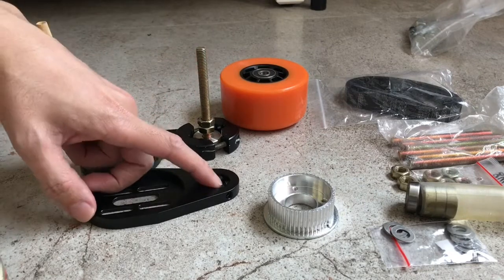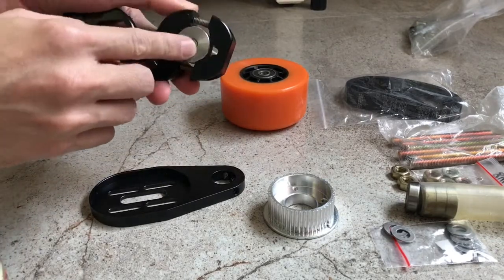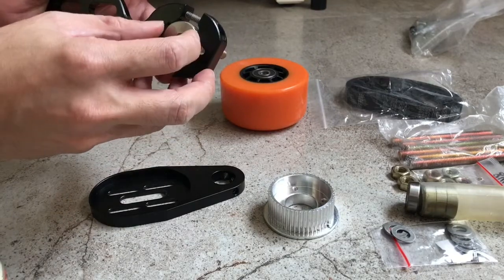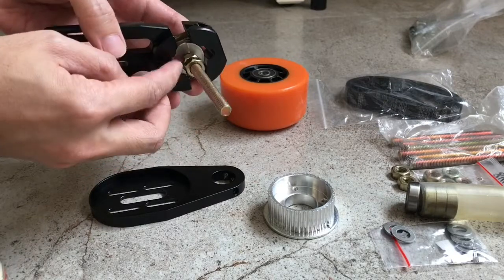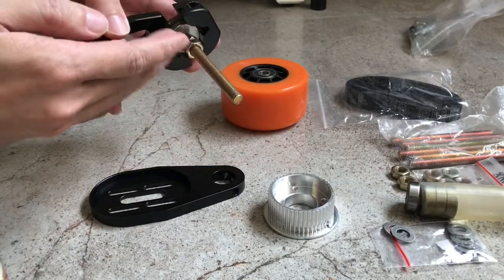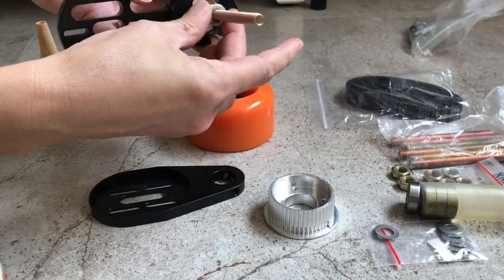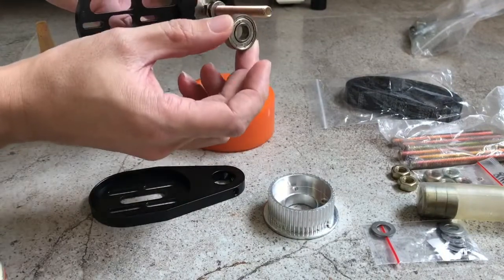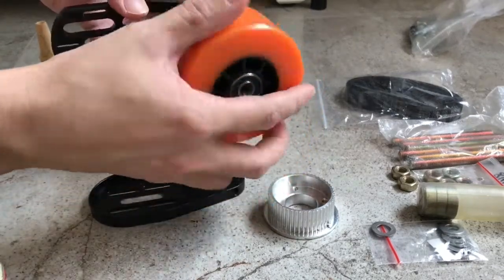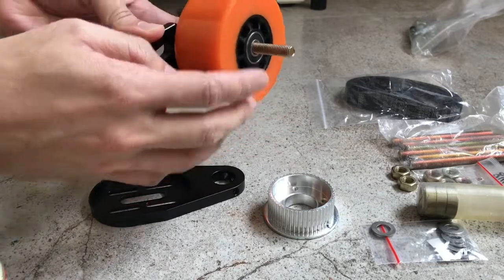But these rods are too thin for the bracket to hold them. So what I've done here is I've used 2 flat nuts which are 22mm in diameter, and 2 of them hold this threaded rod. That allows the bracket to clamp very nicely onto it. And these 2 nuts here are used as end stops to prevent the wheel from hitting against the metal bracket. To protect the bearing of the wheel, let's put a washer, and then let's put a bearing of the same size — this is a 608ZZ bearing. And then next we could insert the skateboard wheel, and it freewheels very nicely as you can see here, it's not touching the metal bracket.